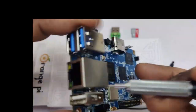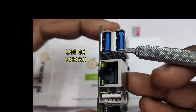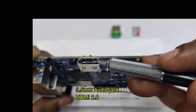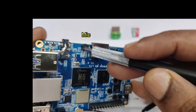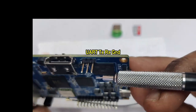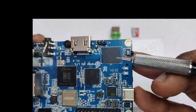There is no barrel connector. There is one USB 2.0 port, one Ethernet connector, and two more USB ports — the top one is USB 3.0 and the bottom one is USB 2.0. There is a 3.5mm audio jack and HDMI 2.0 for video output — it supports 4K video — and there is an onboard mic. Apart from that, for debugging, there are three pins: Ground, RX, and TX.